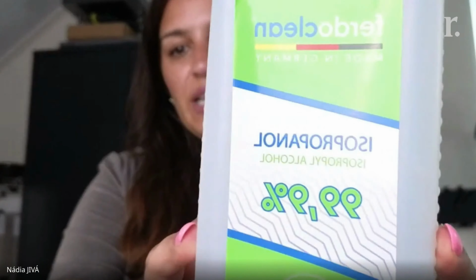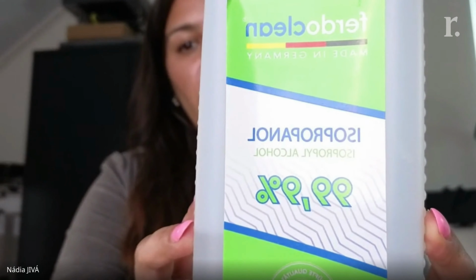There is a trick that I'm not sure everyone knows. If you use isopropanol, it's going to help you burst bubbles. This is not to mix in the Jesmonite, so we're not going to mix it in, but we are going to spray it. I will show you when I'm making the piece, in more detail.